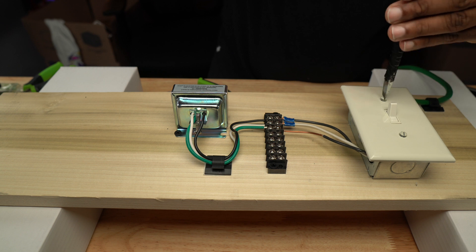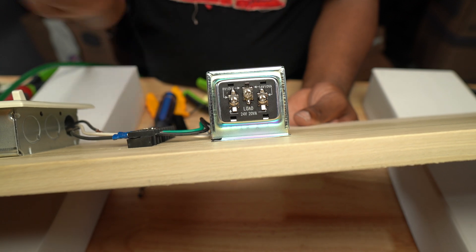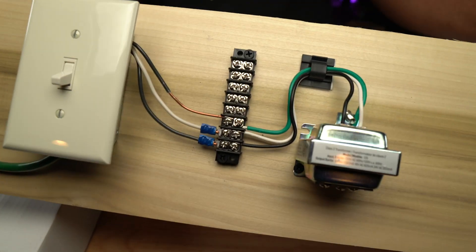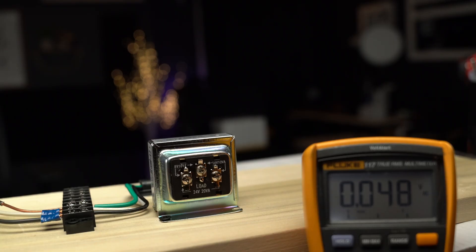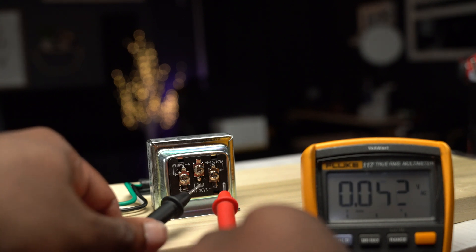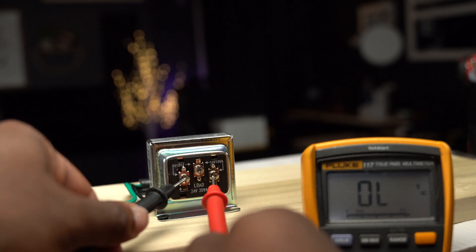You can use this test station for 120 volts as well as lower voltages. On the back of the transformer: the two outside screws give you 24 volts, the middle to the right is 17 volts, and the middle to the left is your low voltage — 7 to 9 volts. Everyone's house has a different voltage, so the output will vary slightly. On mine I'm getting 27 volts, almost 18 volts, and 9 to 9.5 volts — so the transformer is working well.